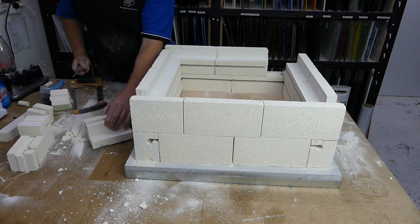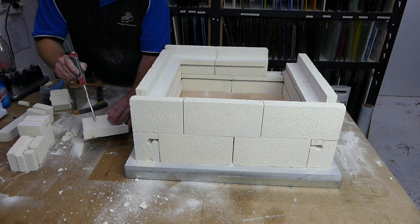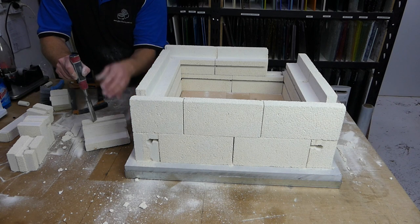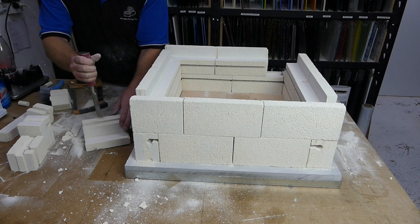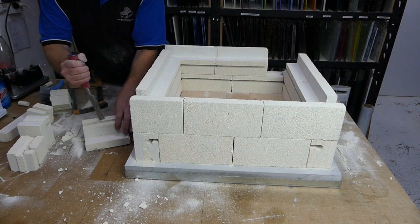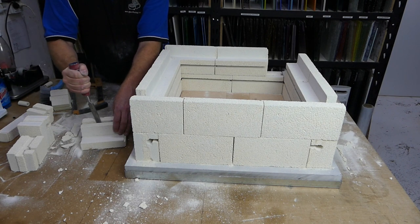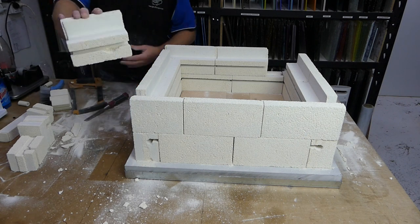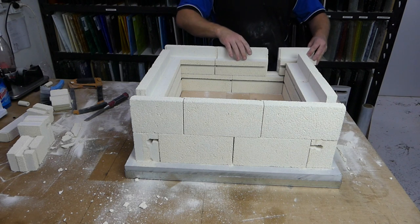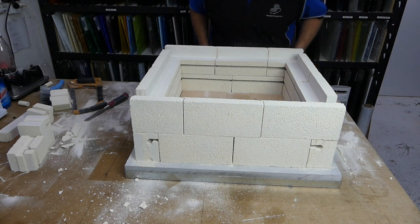We bring the brick down somewhere where you can see me work on it. We've got a mark there and a mark there. So we come down to here. We do one cut like that. We do the other cut like that, just making a chevron. Knock it out. And run the chisel around to make a little teardrop shape. So that's one.